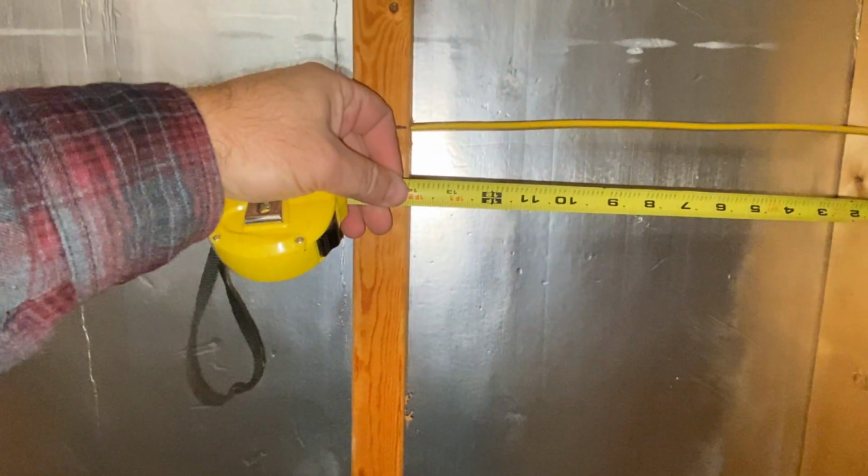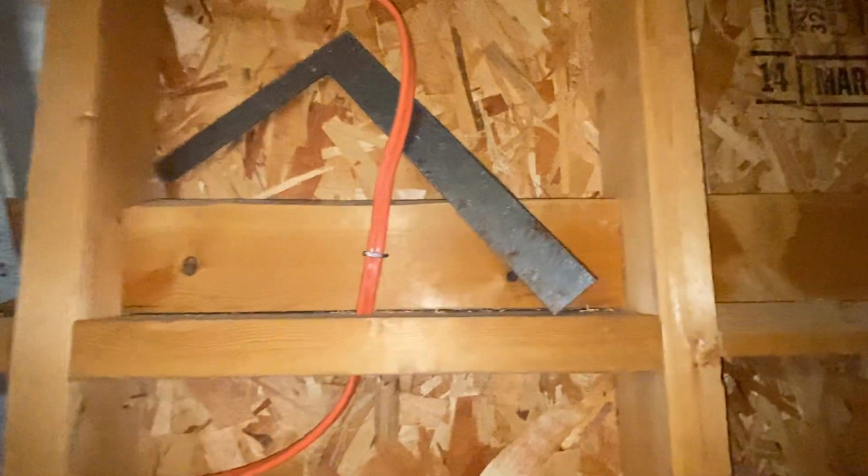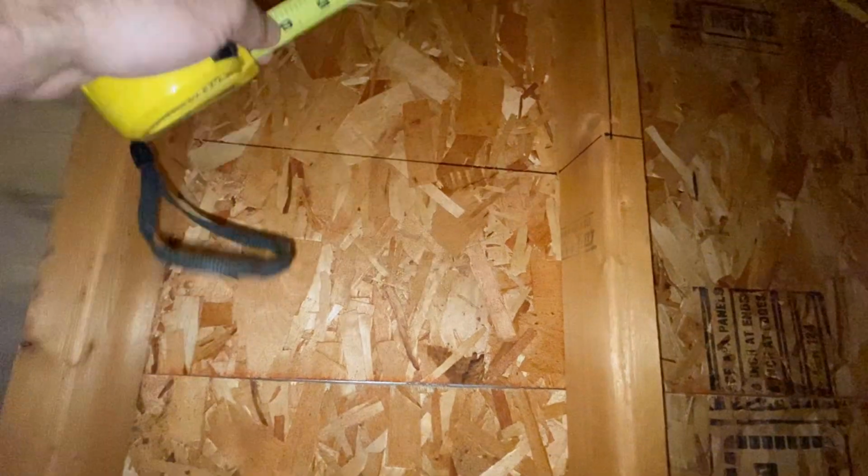Anyway, these joist bays are anywhere from 14 to 14.5 inches wide. That fan is, again, 15 inches wide. So this bay, the last bay that I sheathed, is 15. Yeah, perfect. Except when you go all the way up here, climb the ladder, zoom out, it's not 15 inches wide anymore. It's actually like 14 and 5/8, 14 and a half. And this is where I want to put my fan.